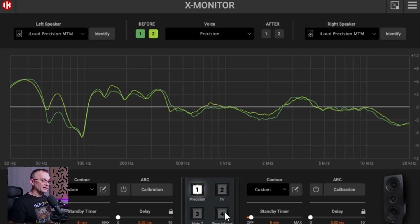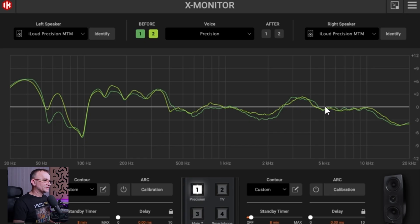Now pay attention. I only improved the symmetry between the speakers and their placement in the room — this is still before any correction of the differences between the speakers. Here it's about a 4 dB difference, but only around 60 Hz. The rest is fairly even. Right away, the speakers sound much more consistent and it's much easier to set everything on them. After correction, it evened out much, much better. There is actually just one small point where these speakers differ — about 1.5 dB. The top end is beautiful and even, and the low end is much more even too. You can clearly see that the position of the speakers, and where they're aimed, matters a lot.